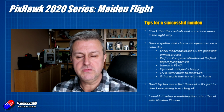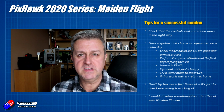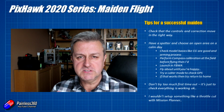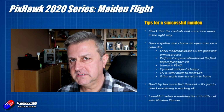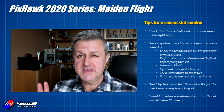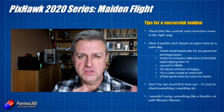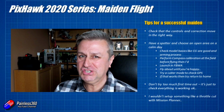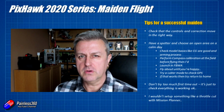I would always recommend having a spotter with you when you do this. I need to say a big thank you to Ross, my flying buddy, who was there for me for the maiden. He's actually wearing my little hat cam and shooting this footage with me so I can concentrate on flying the model and handling anything unexpected that goes on. Don't ignore the basics of your model. Make sure that things like the center of gravity is okay, that all the control surfaces are free moving, the battery's not going to slide around, the battery's fully charged. Do all those things, make sure that nothing's going to come loose before you go to launch it.